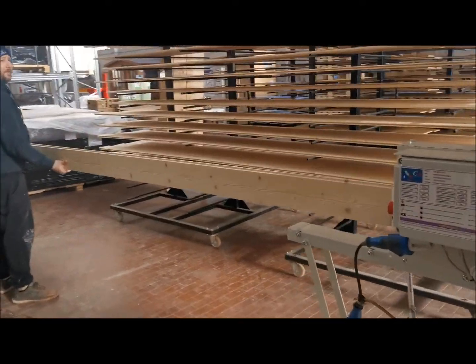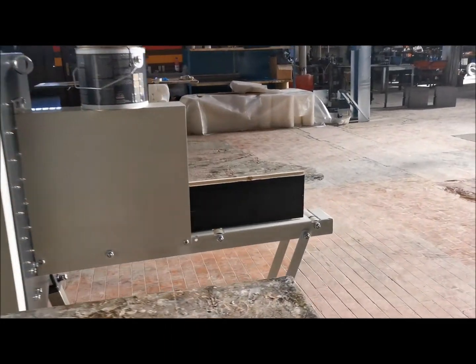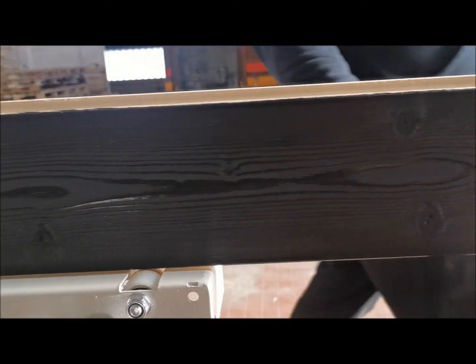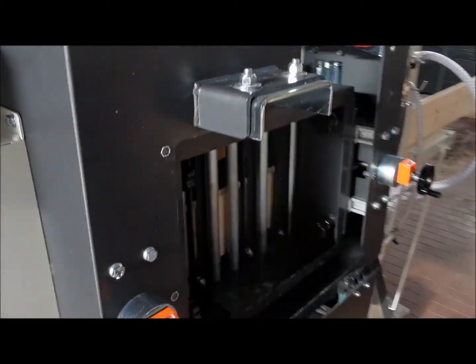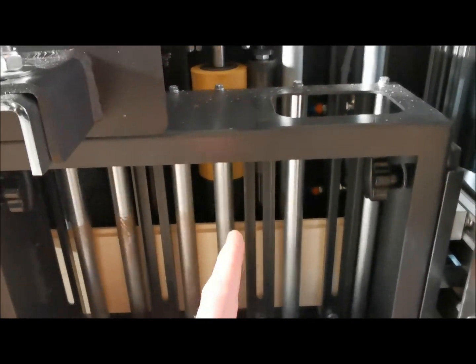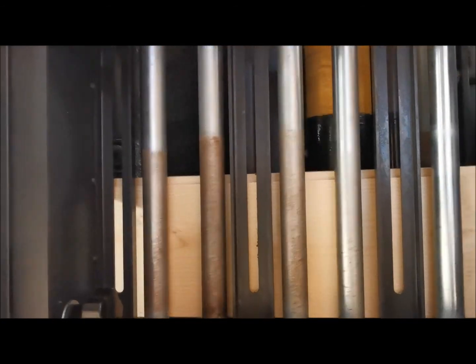We introduce one by one the planks of raw brushed firwood, and here is what's coming out — perfectly applied, evenly and inside every grain of the brushed surface. The machine works so well because we have a vertical system that applies only from bevel to bevel, thanks to the soft foam application roller, and the finishing brush equalizes the product over the wood, just as in a flooring application.